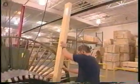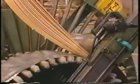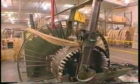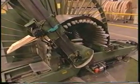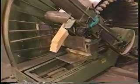Now, Jack, I've always wondered, how do you actually bend the wood to make the radius part of these windows? Well, Bart, the actual bending of the wood takes place in our radio frequency bender. Now, why is it easier to bend laminated material like this as opposed to a solid piece of timber? It's easier to bend laminate material because the laminate material will actually slide. Because of the glue, when your radius is going over, the outer pieces will actually slide on the inner pieces, making a nice, easier bend.